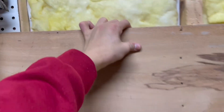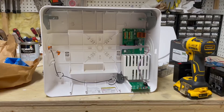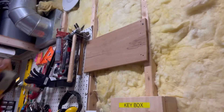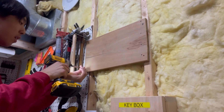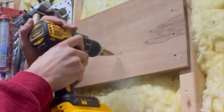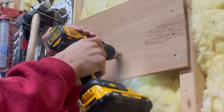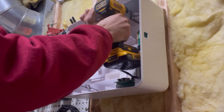Let's install the battery box now. What I'm going to do is put a scrap piece of wood somewhere right here, mount the unit onto this, and then just run wire from this box up. I'm going to have to punch out the center hole — I don't feel like knocking it out with a hammer, so I'm just going to use a step bit and make the hole. I've put the plate up, sent a couple screws in to hold it tight, made sure it's fairly level, marked out the center. I used a metal step bit for the hole, and now we can match the hole with the unit and screw it in.